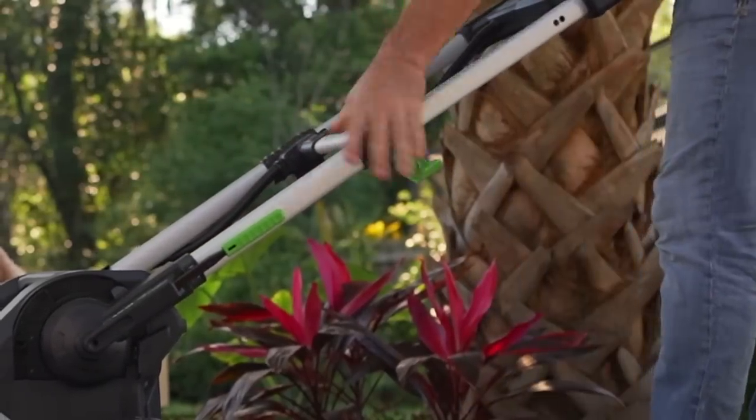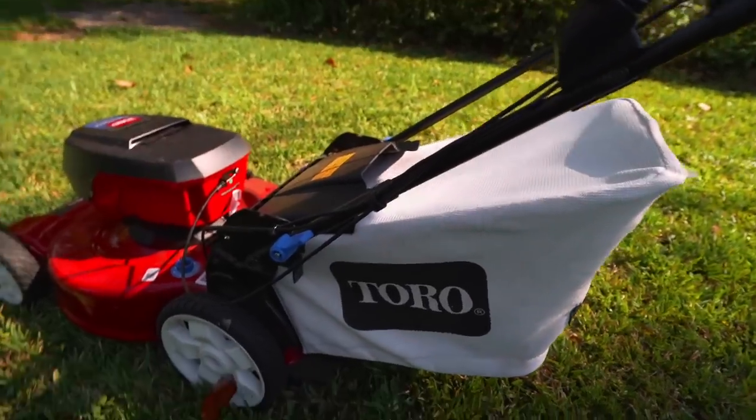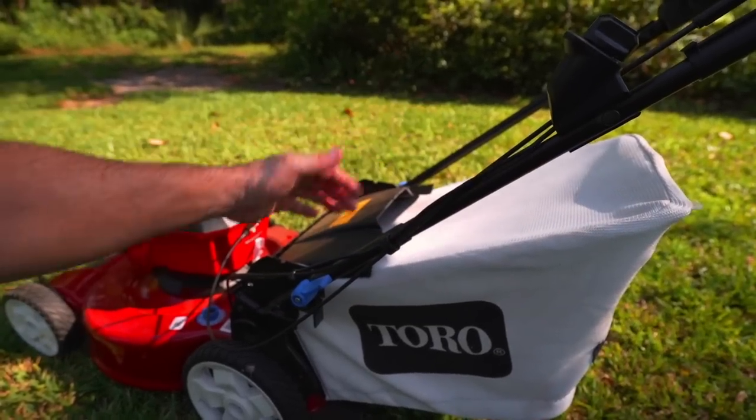There was a short in these wires and they run all the wires up inside of that square tubing. There was some kind of break in there because you're moving them, they're telescoping, they're folding, they're pinching these wires. With them all on the outside here, it protects them better. They don't get messed up.